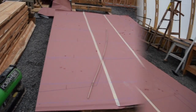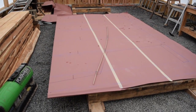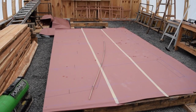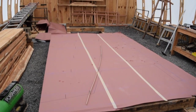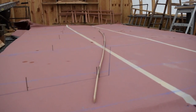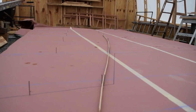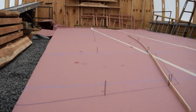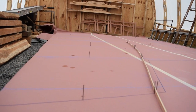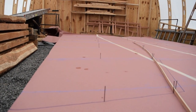When you're reading books and they're talking about sighting down the line to see if it's a fair curve, you can really see it when you get down low. If you look along those nails you'll see that's a nice fair curve. And here's the chine — those nails mark the chine line.